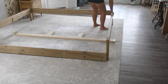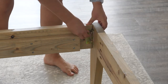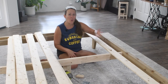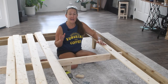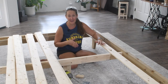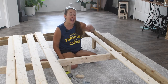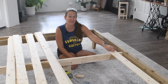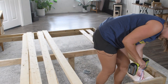The bed frame was really easy to put together — I was even able to assemble the entire thing by myself. I loved how the brackets went together, and it'll be super easy to disassemble when we move. The next step is adding the base for your mattress: either a plywood base or slats, depending on your preference and your mattress requirements. My mattress says slats are fine as long as they're no more than two inches apart, and slats are a lot cheaper than plywood right now. I bought one-by-four furring strips, cut them to length about an eighth of an inch smaller than the opening, pre-drilled one hole with the Kreg Quick Flip on each end and in the middle, and attached them with that two-inch gap all the way across for a sturdy base.